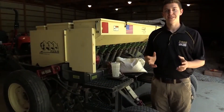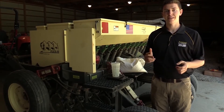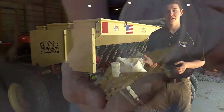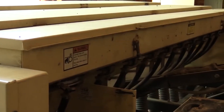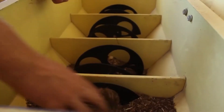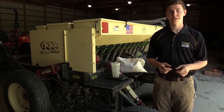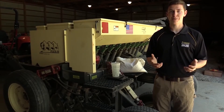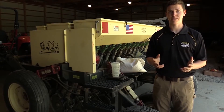We will be calibrating the fluffy seed box for our forb and grass mix. If the seed has been cleaned and most of the chaff removed, you can mix the forb and grass seed together and place it in the fluffy seed box, or mix it with a carrier like cracked corn and place it in the grain box. If the seed is not dechaffed, you should place the forb seed in the small seed box and the native grass seed in the fluffy seed box and calibrate separately. Usually the seed company will pre-mix the forb and grass seed together if it has been dechaffed, but it's worth asking your seed company prior to purchasing whether they dechaffed their seed.